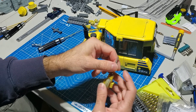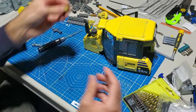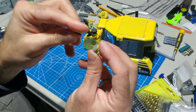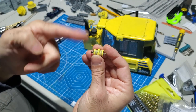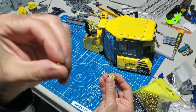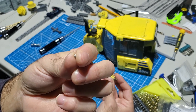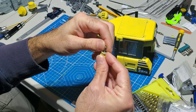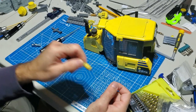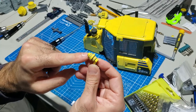Place the shaft in here and put some super glue to hold it in place; then this will go into the track assembly. The little bogey wheels are all designed for M2 screws. The M2 screws will go through the track assembly, one on each side, and then you'll use M2 lock nuts - they have nylon on the inside. Order some M2 lock nuts and they'll go on the outside; just tighten them down enough so they're snug but the wheels still spin freely.